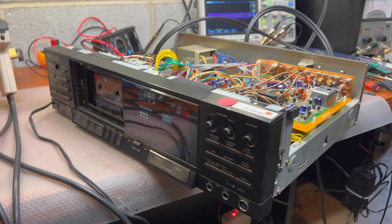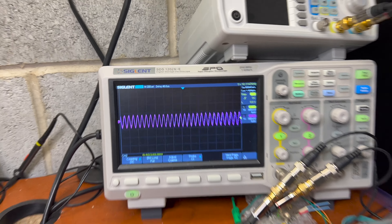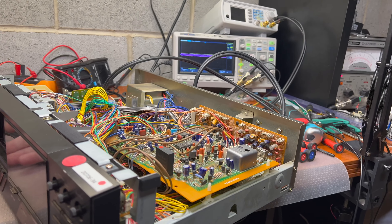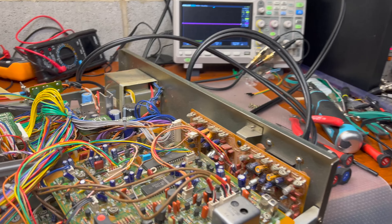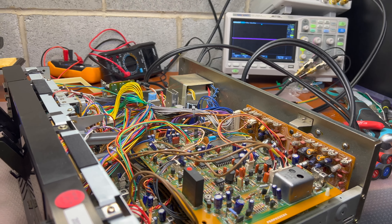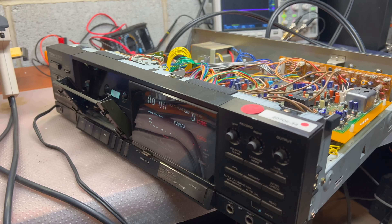And here we're finally playing! It's 10 kHz, both channels, same levels, in phase — everything is fine. There's a little bit of adjustment needed on the frequency response side to make it work better. I fixed the bias generator as you've watched in the previous parts. The next step would be to tune up the recording session to make sure everything will work ideally. Thank you for your time, see you in the next part.